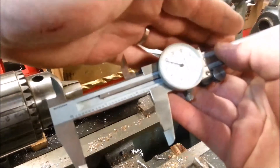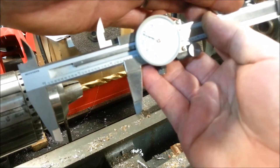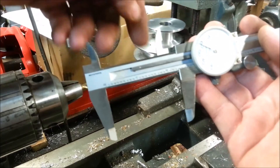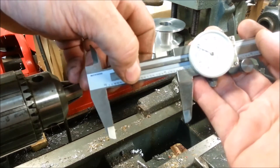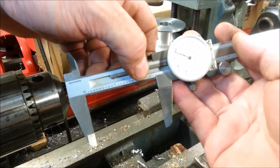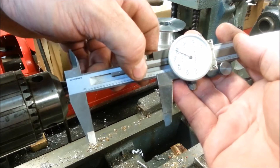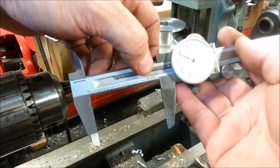And remember we read the diameter to be 2 inches, 358. So that means I need to move the pulley back one half of this distance — so 2 inches, 358 divided by 2 would be 1 inch, 179. 175 is half of 350, plus 4 to get half of the 8, so it would be 179. So 1 inch, 179. I'm going to re-zero my dial.